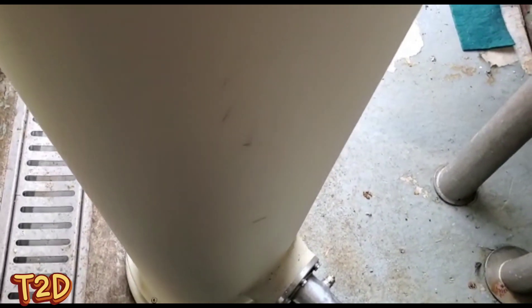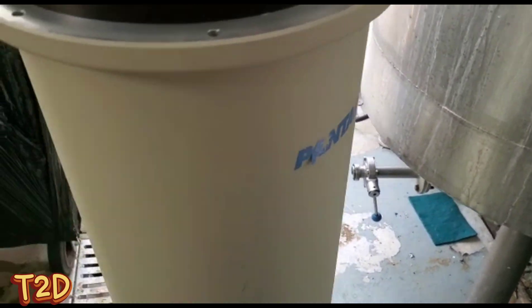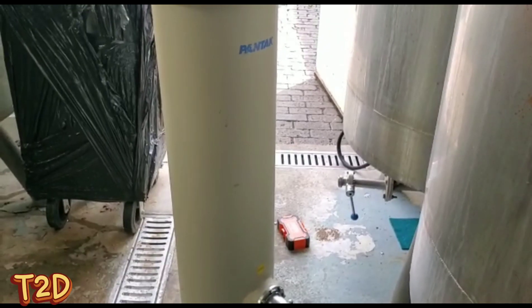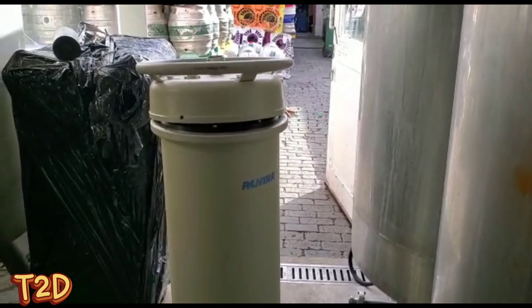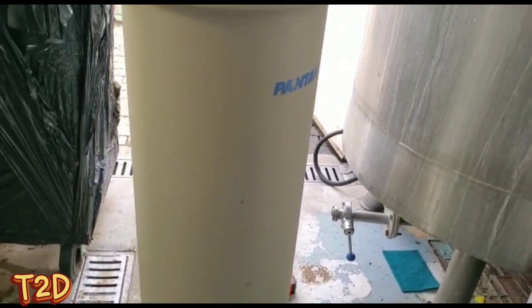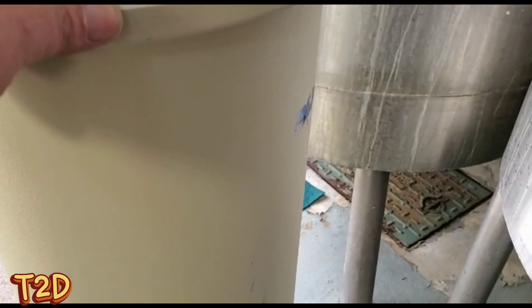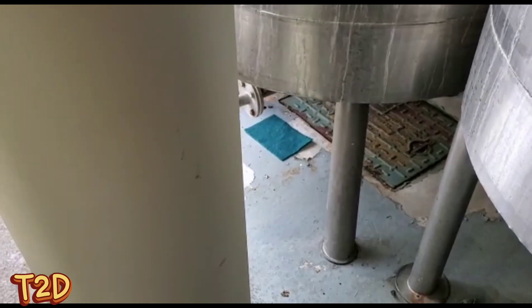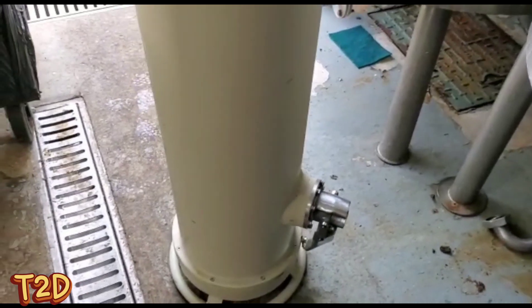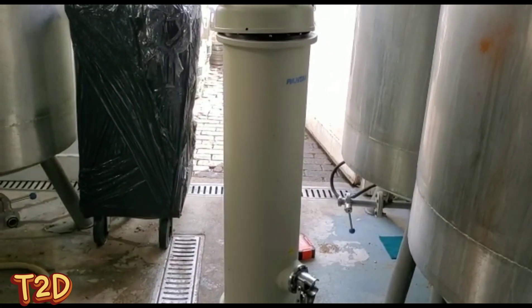It's just a cathode — 150 kV cathode — so that means there is a partner to this that exists. Theoretically it's a 300 kV transformer if its brother was present. It's actually oil filled. The ones I've seen in the past that look like this have been gas filled — they use sulfur hexafluoride, SF6, which is heavier than air and usually have a pressure gauge on top. But this one's oil filled, which is quite interesting.